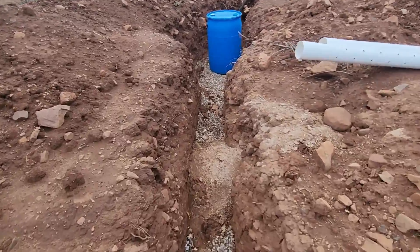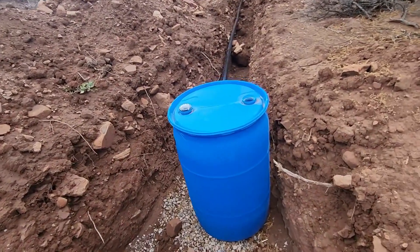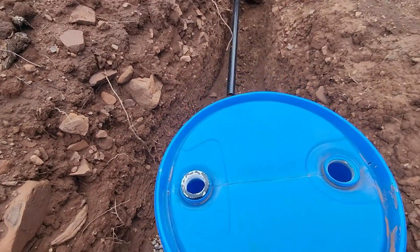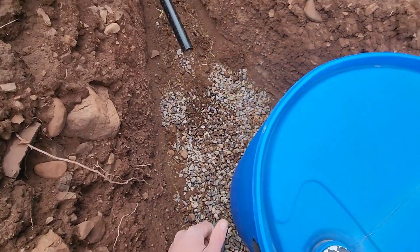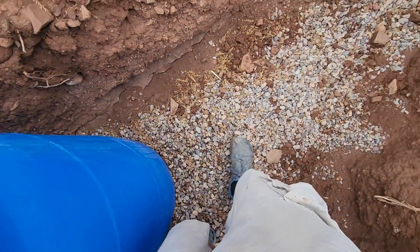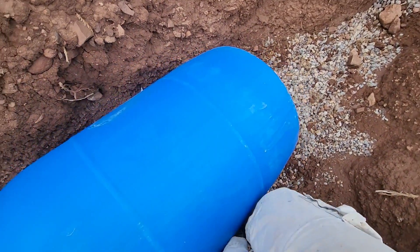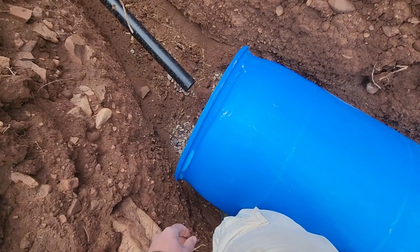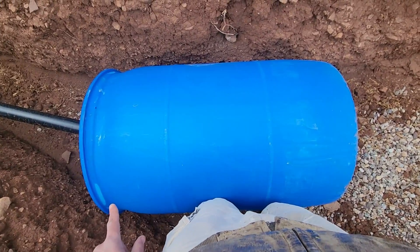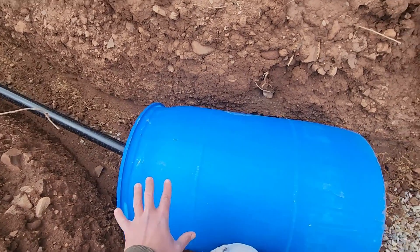Here's our drain line for the septic system — this is just gray water septic, not black water. Just sink, no poop. We have our line coming down at that 1/8-inch slope. The issue right now is our hole is not deep enough at all. We've got a little bit of gravel backfilled in here, and I'm debating running these barrels on their sides instead of upright. I'm going to start digging and see how it goes. We really only need one 55-gallon barrel, but I'm going to have two — so even if I lose some volume it shouldn't be a big deal.